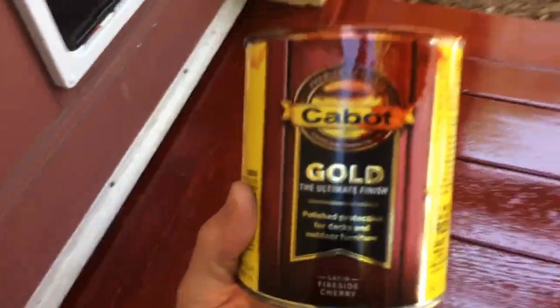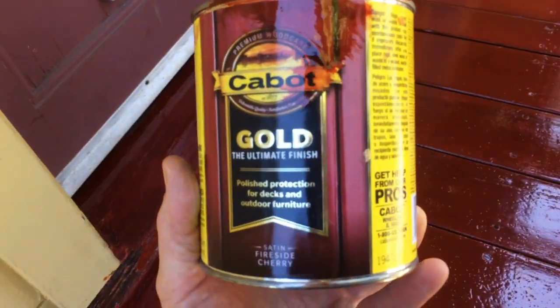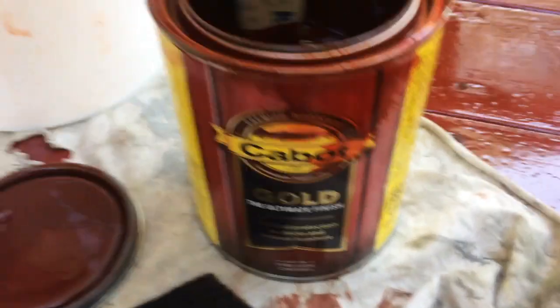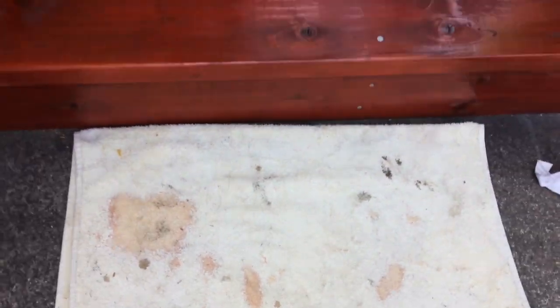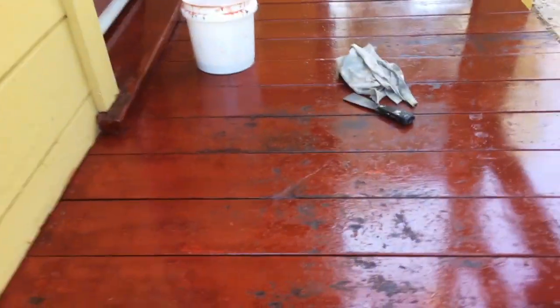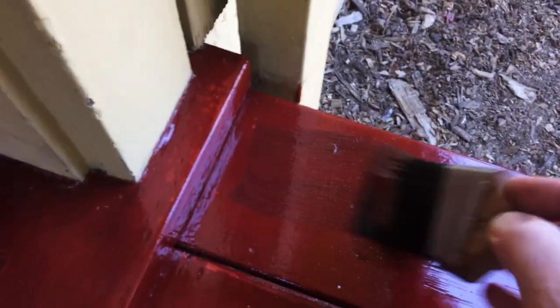Made it to Kelly Moore. Here's the product again. I put a couple of ice cold beers into Dave's hand, because he put this gold into my hand. It goes without being said — stir thoroughly. One thing I like to do is keep a towel right there at the foot of the stairs so you can knock the worst of the stuff off your feet as you go on. The second coat is pretty much the same as the first coat. Not too thick — they emphasize on the can to put it on thin. Two thin coats. Just read the can.